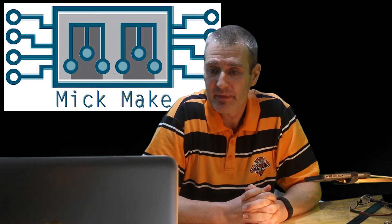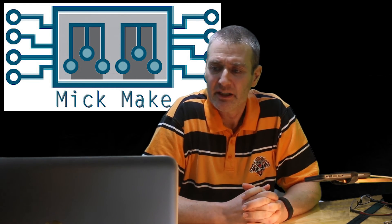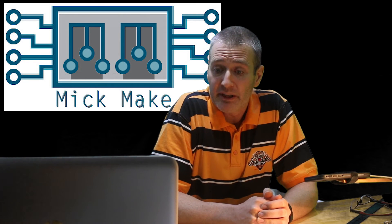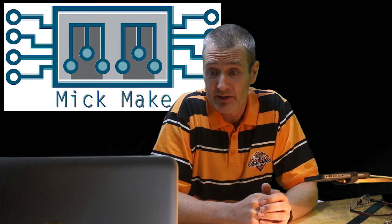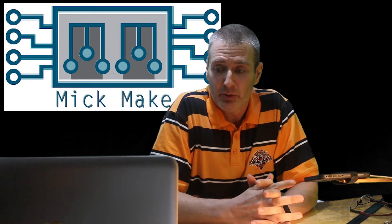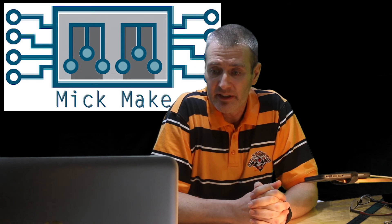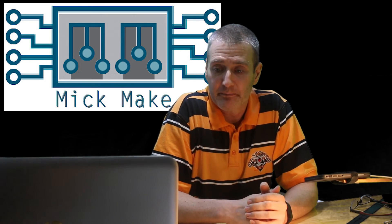There were a few hiccups during testing. Very occasionally the BLE module would lock up, and this seemed to be due in part to the amount of data streaming through the BLE module — too fast and it would lock up solid, forcing a reboot. Also, out of the four modules I purchased, two had issues: one BLE module was dead on arrival, and another locked up after a week of testing and never recovered. Additionally, there is no way to control the BLE module when a device is connected — issuing any AT command will disconnect the device straight away, meaning you have no fine-grain control during an in-flight application.